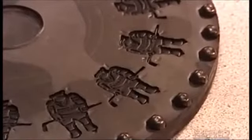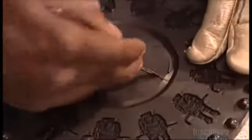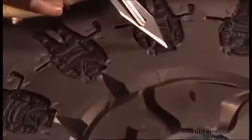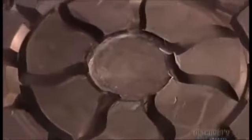This will be the production mold for producing this pin design. Now, using a surgical knife again for precision, they carve out sprues — channels that during the casting process will direct the flow of molten metal to the cavities. They also make smaller curved channels, called runners, to filter out any air or dirt particles. It's crucial to position the sprues and runners correctly because this mold produces an entire line of a particular pin. Mess up, and they'd have to remake the mold from scratch.